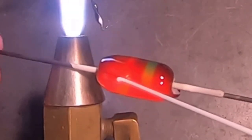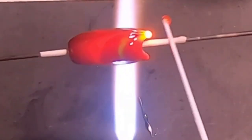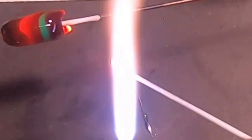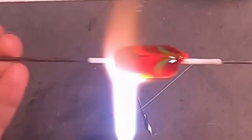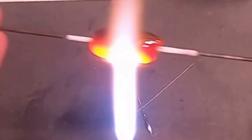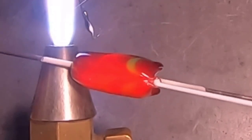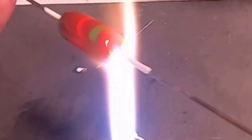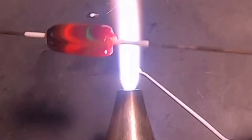I'm going to use that stringer and just gently pull a little bit off of there, and it looks like I'll be able to do one more going this way. Then we'll turn it around and rake the other way. You're just heating and you're grabbing, and with the stringer you want to make sure you're really pulling in there because the stringer can cool down — you don't want to get stuck in the middle of a pull. Now we have our little guys here, we can just fold those in.